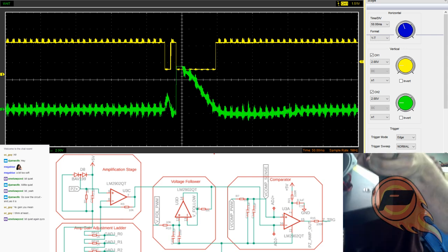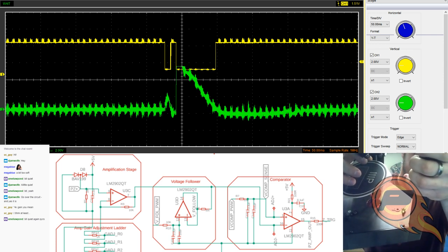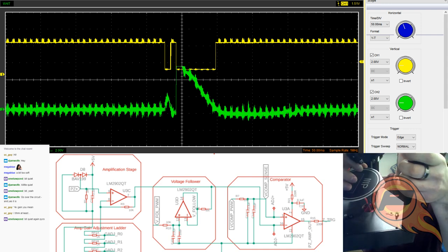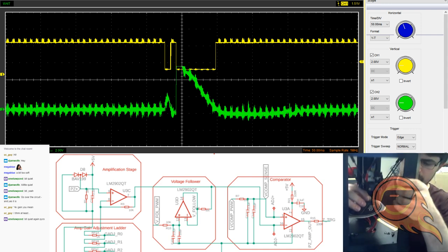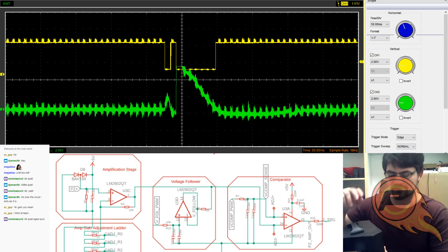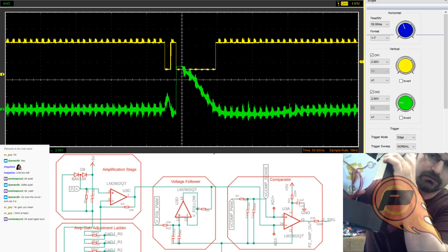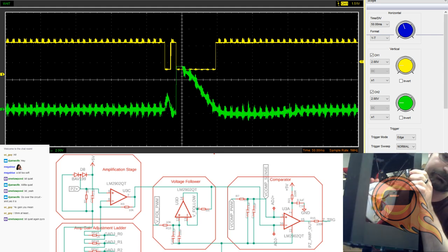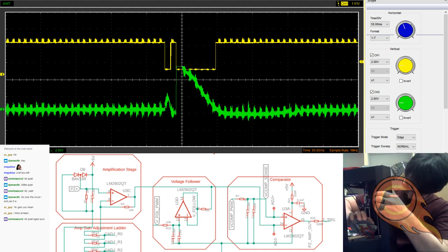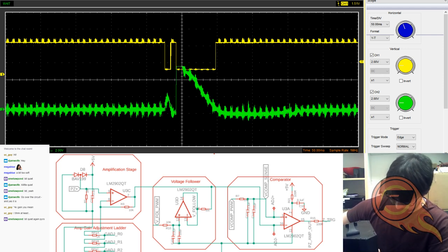So on the bottom of this thing, you'll see it's got these little tactile switch buttons, which are kind of used for controllers or for your mouse, things like that. But they're not really good for doing bed leveling, because there's no consistency with the actuation, which is why these particular printers have such a concave sort of issue with their bed leveling. So at any rate, what I've done is pasted the piezo discs on the bottom of this thing using some thermal tape. It's the kind you use for pasting heat sinks on CPUs and whatnot, so it shouldn't release with the heat, thankfully.